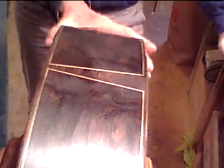So there's still one that's open. I can put a little bit more pumice on here. I'll wet this with a bit more pumice. And you don't want to get pumice dry on the guitar, because that's when you end up with a layer. This is all open here. You've got to push a little bit and force it in there. Now that's pretty much filled. I'd rather leave a little bit of a layer to sand off than pull it all out. So here, I'll fill again where I saw those open ones. Okay, that looks pretty good now. And I'm just going to carry on and go around.